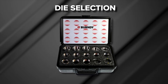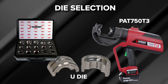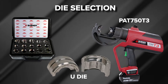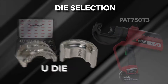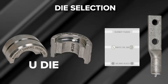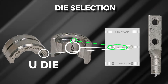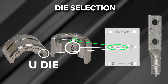Chapter 4: Proper Die Selection. The die set will depend on the installation tool being used. For this installation, we are using the 12-ton 750 Series battery-actuated Patriot T3 tool, which requires U-dies. When selecting the proper die set, installers can verify the die with the connector by using the unique Burndy die index numbering system and color code. Die index number 298 and white color code for this installation indicates specific information that can be verified before installation.